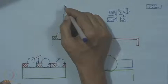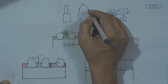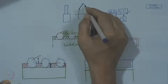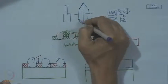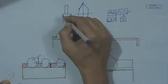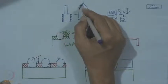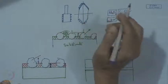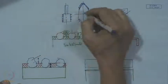The preform can be machined by precision machining, and over that, the grit can be anchored by the electroplating technique. Only the preform is necessary, and we can do away with the molding requirement. That is one of the greatest advantages of this technology.